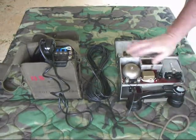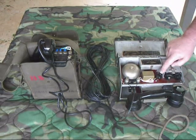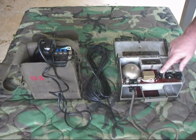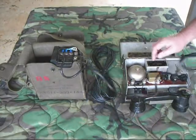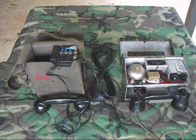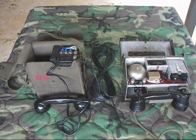Audio is a little weak on the receive end on the earpiece on this, but I'm wondering if I maybe have a bad earpiece or need to clean some contacts up. The other problem you run into is how do you call the E8? There's no hand crank on this. Now, inside the handset you can hear a little bit — it's not too bad, it's okay. But on the receiving handset it's really loud. So you could use the Morse code key to signal the phone on the other end. You would have to have somebody listening to an E8 or they wouldn't hear it. The British actually had portable field switchboards that would receive this signal and light a little light on that line, similar to our SB-22, which was the old BD series during World War II.